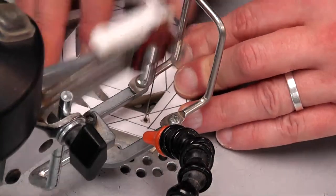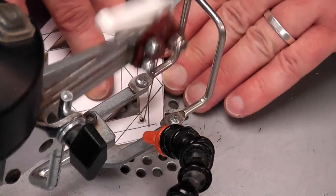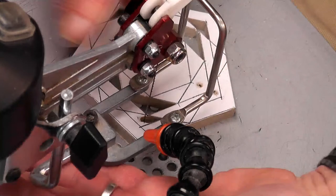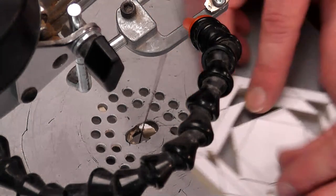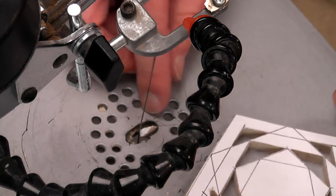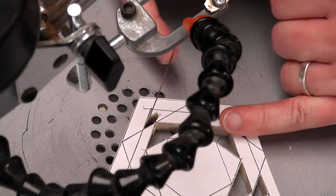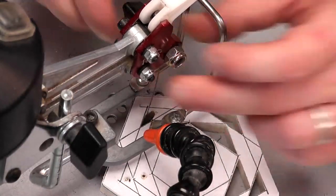You can see how quick releasing the blade and putting the tension back on is on this machine — really nice and user friendly. Sometimes if you're moving your project across, a chip in the extraction plate can get stuck and become a pivot point, actually making you cut into your project where you don't want to. It can start turning the project as you feed it onto the cut — so always fish those chips out if they go underneath.